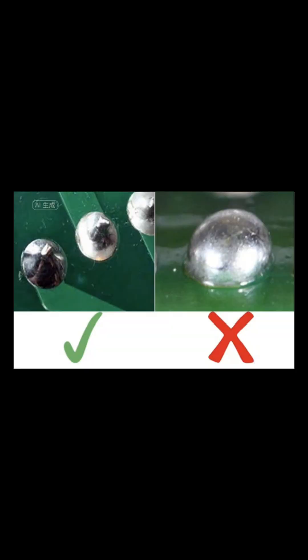If there are no ways to solder the components directly together, use the shortest wire possible to reduce the capacitance. Use thick 1 mm copper wires to reduce the resistance. Soldering should result in shiny surfaces that also reduce the resistance.